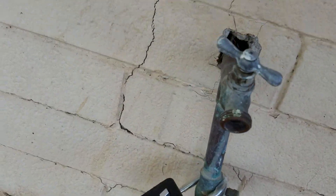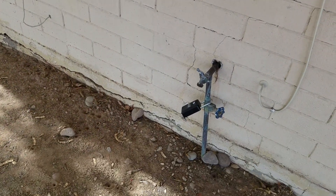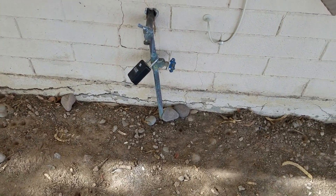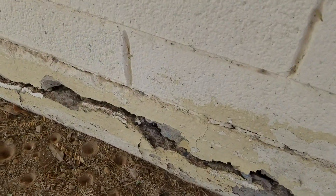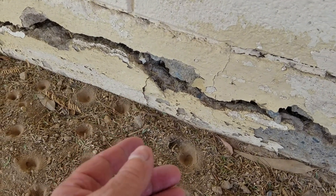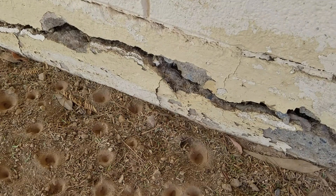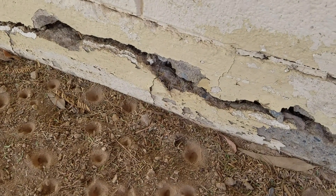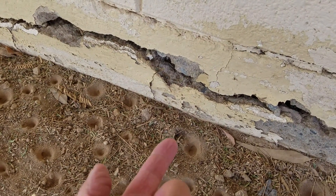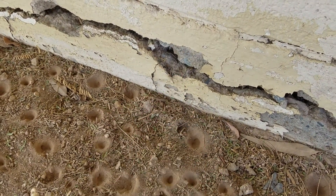You have stair stepping in the walls. The wall is actually coming out slightly, and what's going on here is the rebar on the interior is rusting. Because this stem wall isn't waterproofed all the way down to the bottom, the moisture comes in from the dirt just below the paint and attacks the rebar.